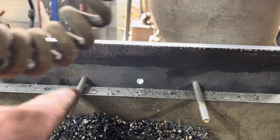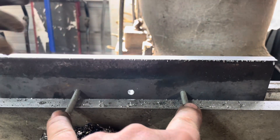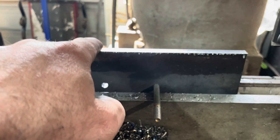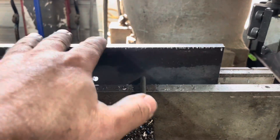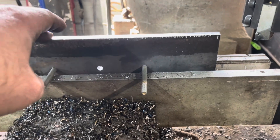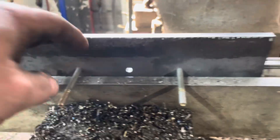We originally plasma cut the parts and drilled our holes for the center supports. We use two pins to machine it quickly and make it parallel, ensuring both sides are parallel to each other for the machining process we need to do later. We're not worried about the finish — we just want it to be parallel.